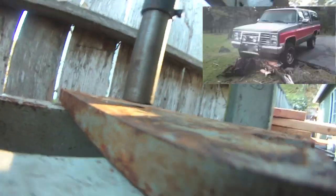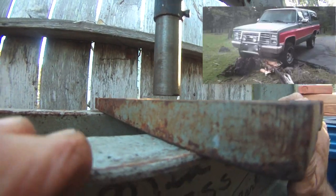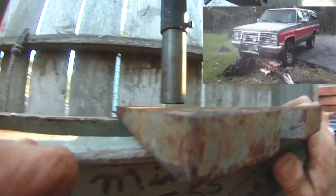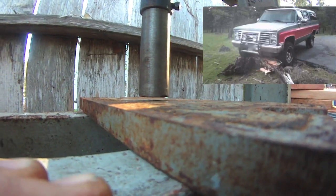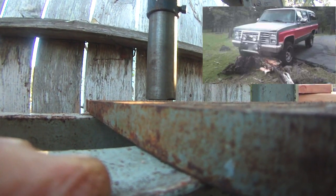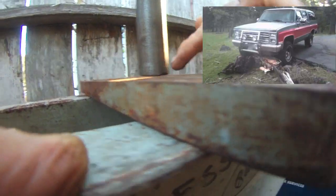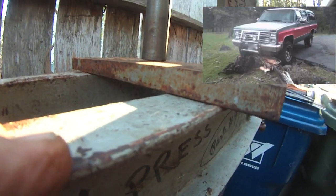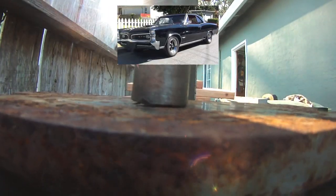So I was having issues trying to get that thing to square up. I took a piece of one-inch thick plate steel and tried to put pressure on the system. I had loosened all 12 of those bolts, and it didn't push it back up. So I have to get in there and oval those holes, I suppose, to get this frame square.